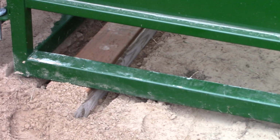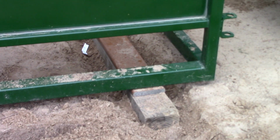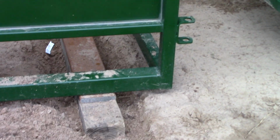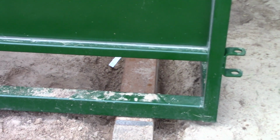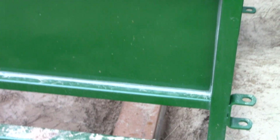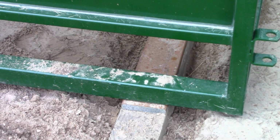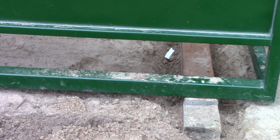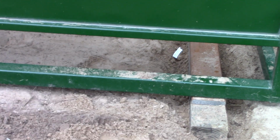Leveled it out, and again, probably plan is at this point here and also at this juncture right here, we'll put some earth anchors in again and just tie it down and probably fabricate a channel bracket and fasten them down to each support right there. This way here, we're keeping it off the ground just a little bit, and we'll be able to put the load bars for the scale on that one, or I should say on both of them.